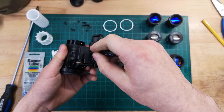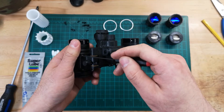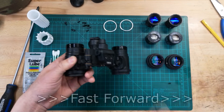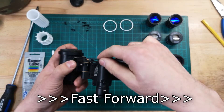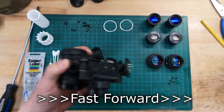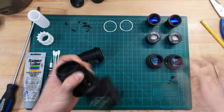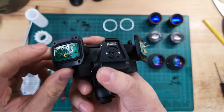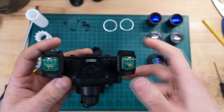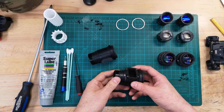To remove the pod from the bridge, you just remove these four 1.5mm Allen head screws. The right pod and left pod are identical, so it doesn't matter if you accidentally swap them. Once the pods are removed, you can see the connector tabs that will contact the tubes — these are spring-loaded pin connectors that will break very easily if you assemble this incorrectly.